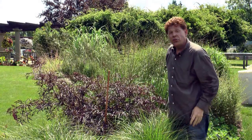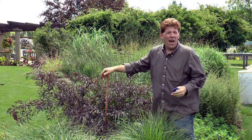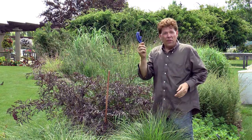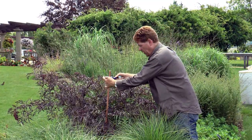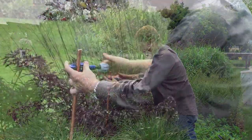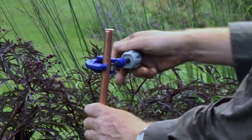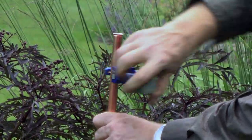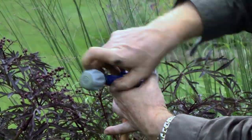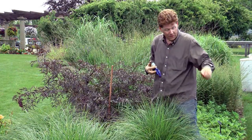Now, whenever you strike the copper, you make a dimple flat on the top, which we have to remove. The way to do that is with a pipe cutter, also available at any big box store. You open it up, and you simply tighten it a little bit each time you rotate the piece, and it neatly and cleanly snaps off the piece of copper.